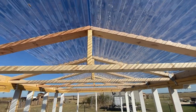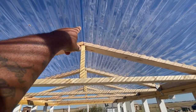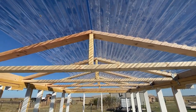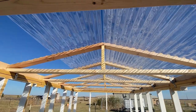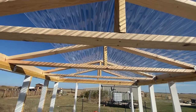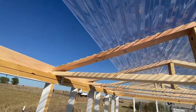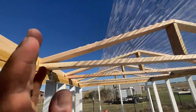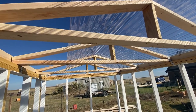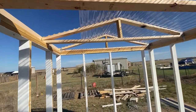What I'm going to do is get some Flex Seal tape and put it over the top of this channel, or I might even do some insulation tape, because it will have a foam, and I have to put a metal channel over the top so it doesn't leak in here. And I'm going to use some spray foam. I got cans of spray foam, but I had to do all of it except this row so I can get my ladder up here and put the channel on the top. If I don't, I won't have any reach to put the metal channel on there. There you have it, man.